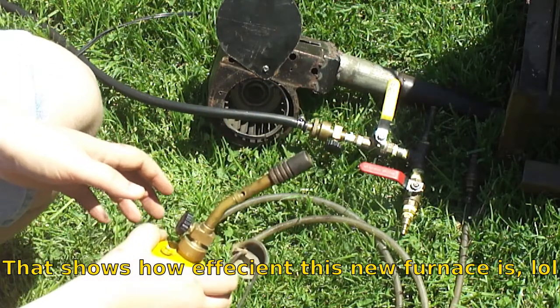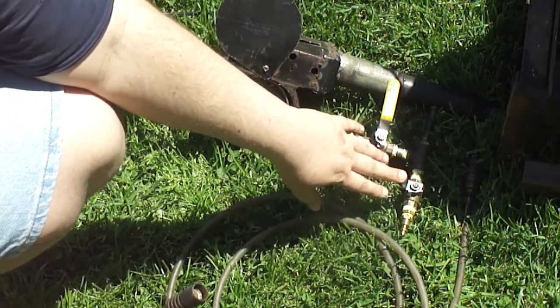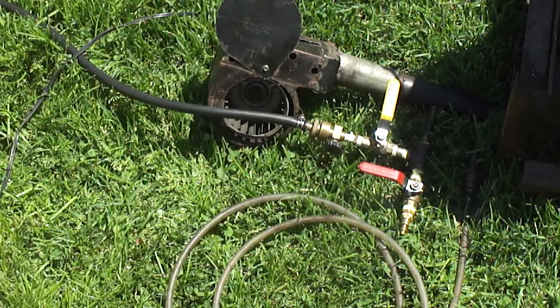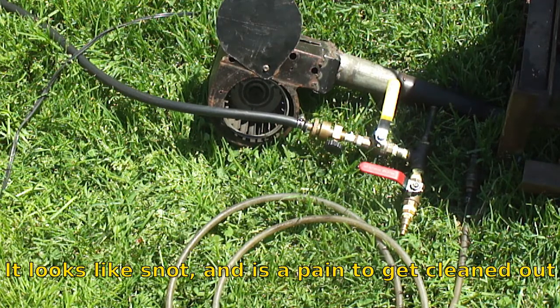So this was just designed for the preheat line. The compressed air, I usually run about 30 psi, 30, 35, maybe 40 at most. That gives a good atomization and a good vacuum also for the oil. For the oil, I like running cooking oil, mainly because it runs clean, it doesn't create any problems. All the problems I've had in the past with it clogging up was because I was mixing the cooking oil and the motor oil together, or switching back and forth, and it would collect a little bit in the burner. When you do that, those two mix and it creates like a booger that clogs up everything.